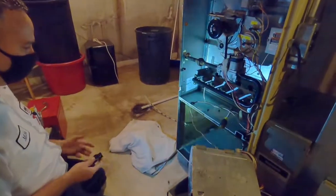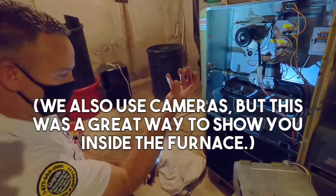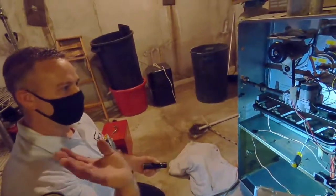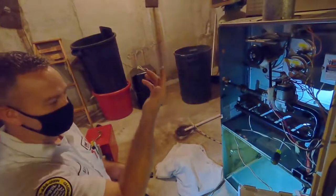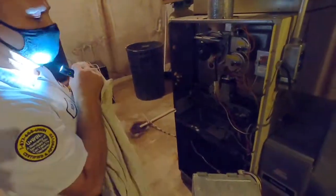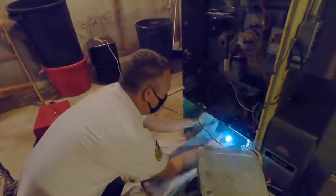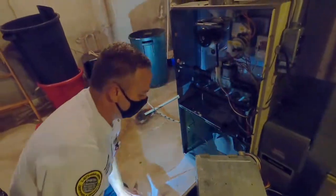What I'm going to do is crawl in there and look with my flashlight and mirror up inside this thing. The heat exchanger works kind of like a serpentine — it slows down those gases to produce heat so you're not wasting it all going up the exhaust. To make sure the home is safe, you want to have your annual heat exchanger check, maintenance, and safety inspection done.